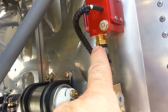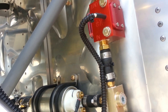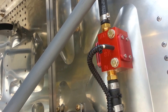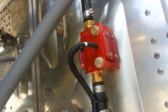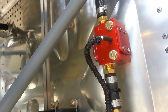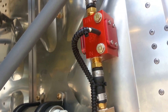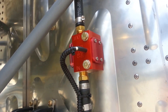The fuel that goes up here is now under pressure at 43 pounds, plus or minus three pounds. This particular builder has a fuel transducer showing fuel flow, and we're keeping a nice straight path going into and out of it so we can accurately calculate the number of gallons. It's in the high-pressure line going directly to the engine. There's no need for two transducers because you're not calculating the fuel return — just the fuel that goes to the engine.